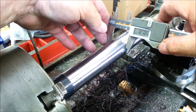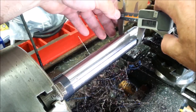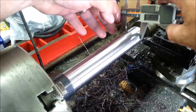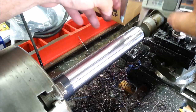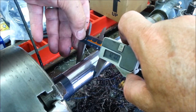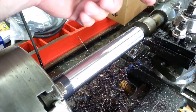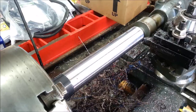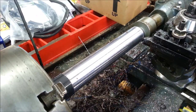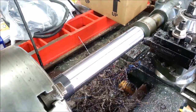1 inch 270, that's where I expected to be. Boy, that sucker is hot. 1 inch 271, 1 inch 270. I'm occasionally getting bigger measurements - I must be getting debris. 1 inch 271.5, 1 inch 269, 1 inch 270. I think I'm a little bit out of alignment. I'm a little bigger here, which means the tool post needs to come back this way.